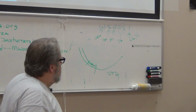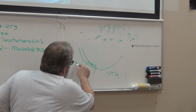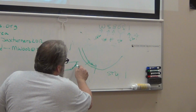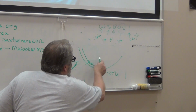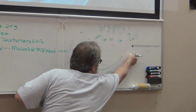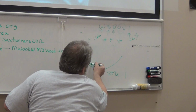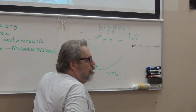Who cares, you know? On my 80 degree gouge, it kind of looks like this. All I care about is this little bit here, and this is about at that 80 degrees. So when I come in, first of all, if I want to start up here, my handle has to be way over here for that 80 degrees to come in with a cut. But when I get here, I can cut on that short bevel. The heel isn't rubbing at all, and it allows me to come through.